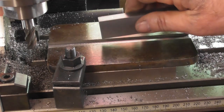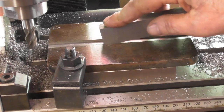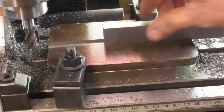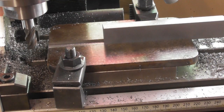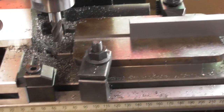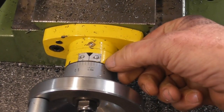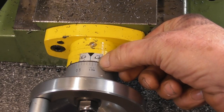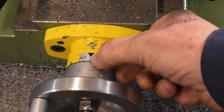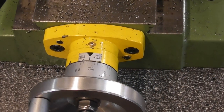I've got it fitting - and it does go in with absolutely no movement, so I'm happy with that. More luck than anything else. I just took a progression of small cuts - 0.15mm one side same as the other side, then another three cuts at 0.05mm each, and that's basically got me to where I am. We're happy - move on to the next step.